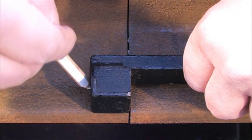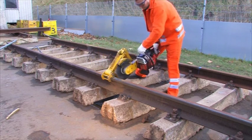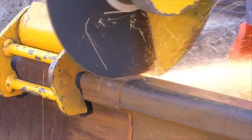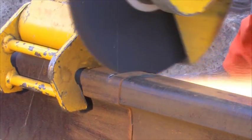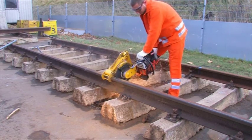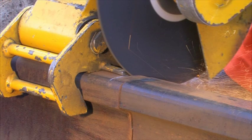The first step of Thermit welding is to create the welding gap. This gap shall be straight and at right angles at all sides. The allowances for gap widths shall be kept. The preparation of the welding gap can be done in different ways, by disc cutting, as shown here, or by flame cutting. Gap width is to be marked for the purpose of cut.